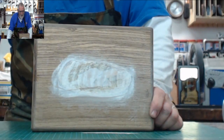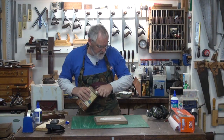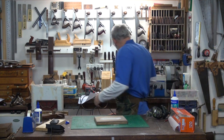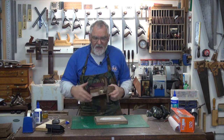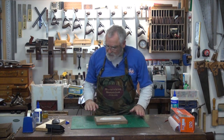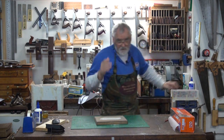This is a bit of marquetry we've been working on for the last three weeks, and that white stuff on there is Plaster of Paris. The reason I use it is because it fills in all the little hairline cracks and grain that you might miss. Now you don't want it to fill huge voids — if you're going to do something like that I would suggest you use wood putty.